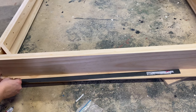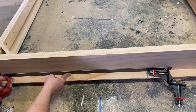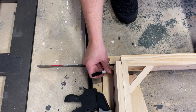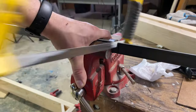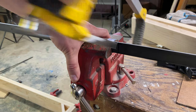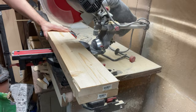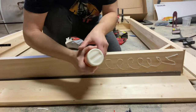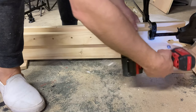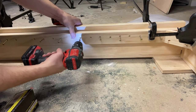Get a buddy and carefully flip the table over. Having it flipped gives you something to rest the metal strips on while the epoxy sets. I didn't have any clamps deep enough to properly clamp these down, so I just leaned things against the strips to keep them in place — hey, if it works, it works. I did have to make some cuts since the strips only come in three-foot lengths. The two-by-sixes were awful — it took me what felt like days to find the straightest, unwarped boards at three different lumber centers, and even then they weren't great. But it's super important since these are on the exterior and everyone's going to see them.